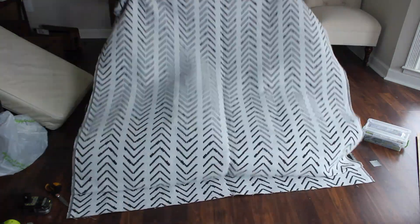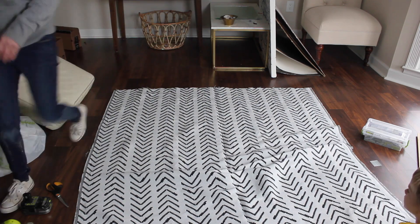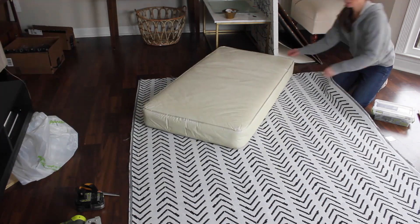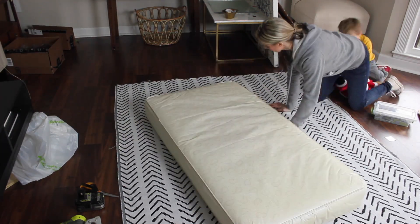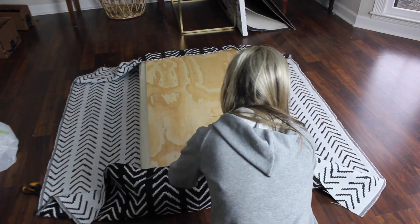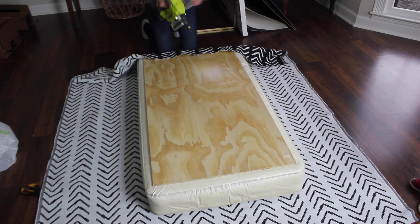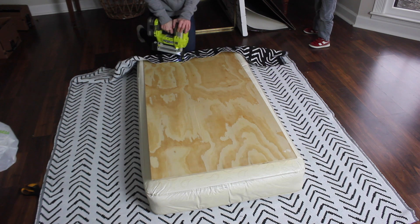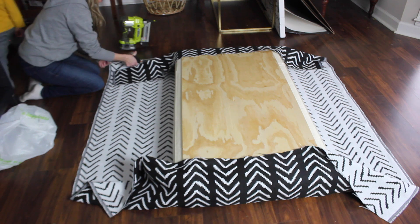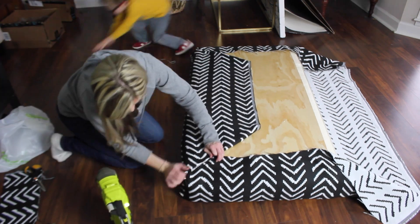Now it was time to cover the mattress. I used our old crib mattress and bought a couple yards of thick upholstery fabric to cover it with. I wanted to make a no-sew cover since upholstery is not my strong suit, so I laid the fabric face down on the floor and centered the mattress on top. I had a little helper! Then I laid a 2-foot by 4-foot sheet of quarter-inch plywood on top so I would have something to staple the fabric onto. I used my cordless crown stapler to attach the fabric to the plywood, doing the ends first and pulling tightly as I went, and cut a section out at each corner to reduce bulkiness.